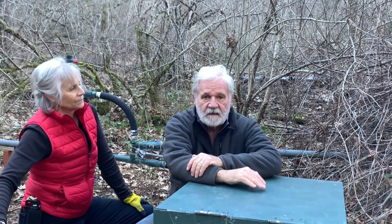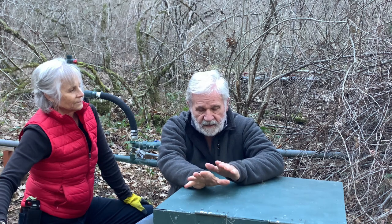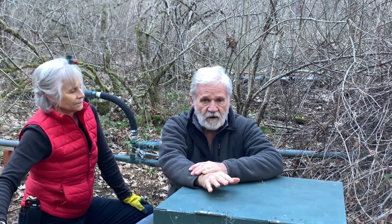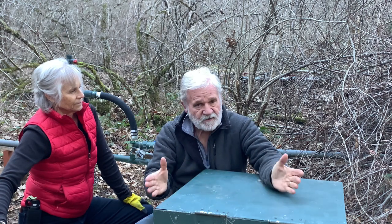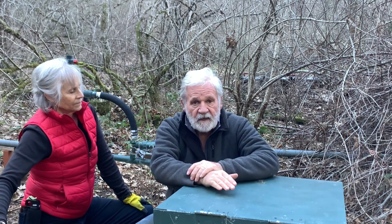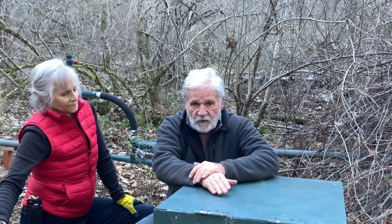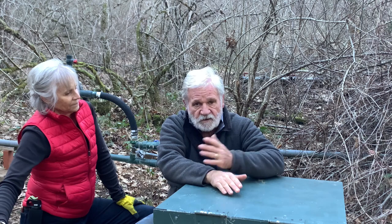Well, that's our report. We are very happy with our micro hydro system — it generates about seven to eight amps every hour, 24 hours a day. That turns out to be about the same amount of energy our four 200-watt solar panels put out if they get five hours of sunlight. So when it's raining we use the micro hydro, and when the sun is out in the summer we use our solar. It's all about the same.